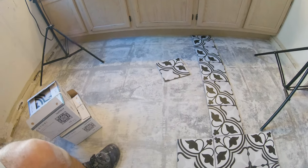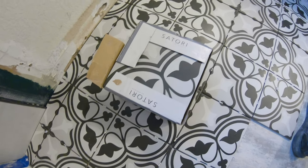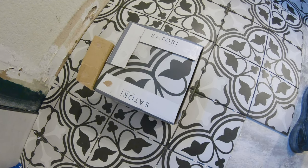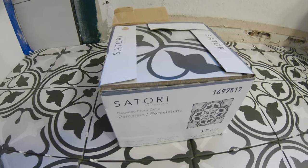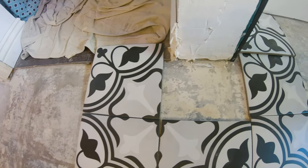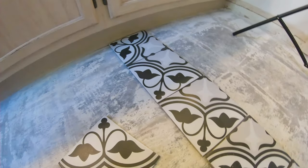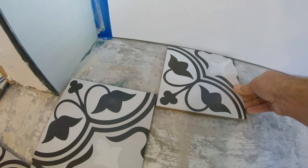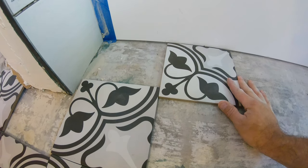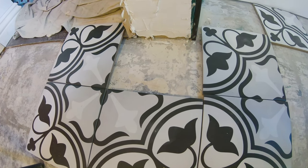Get ready for some wild floor tile. Eight-inch square with a little floral pattern — put four of them together and they make one piece. This is the tile I'm using. At the time of purchase it was 99 cents per eight-inch square tile, purchased at Lowe's. What I'm doing now is looking at how far over I'd like to put one full piece right on the edge of the tub. However, that would leave me a sliver at the hardwood. I measured up one tile at a time from underneath the toe kick, and that leaves a nice amount to fill into the tub — and three quarters of the tile to fill into the hardwood. I'm fine with that too.